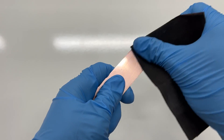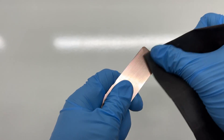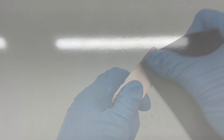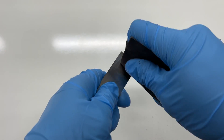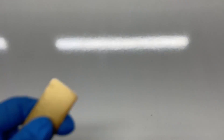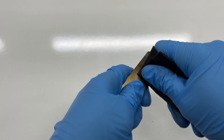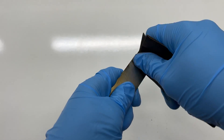If you have applied a hard metal such as nickel, palladium, or rhodium, removing the plate can be tedious, difficult, and time consuming. Gold is easier to polish off, but it still takes some time. Removing precious metals from the surface is also not very cost effective.